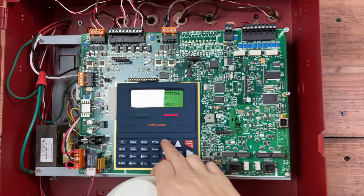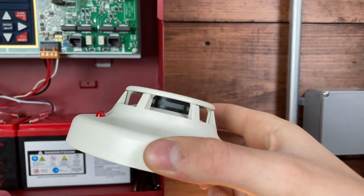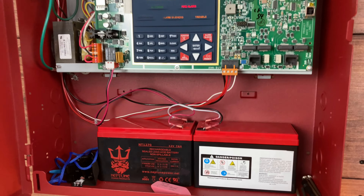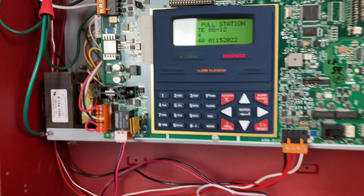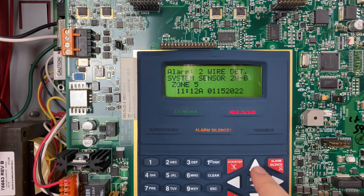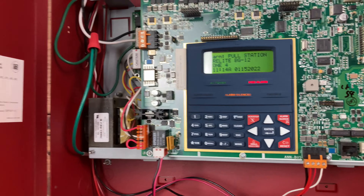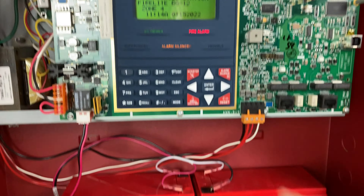Let's go ahead and take this off — it is going to go into trouble because of the way it's wired. I'm just going to try to blow that out a little bit to make sure there's no extra smoke in there and it won't go off again. Okay, I'm going to put that back on the base. The trouble automatically cleared itself. The only things we have now are the two fire alarms from the two-wire detector System Sensor GWB and the Firelight BG-12 pull station on zone 4 and zone 5. Since those are both aired out and reset when it comes to the pull station, we can reset the entire system.